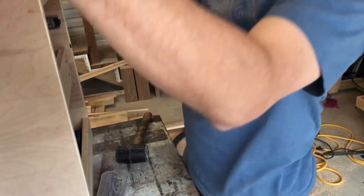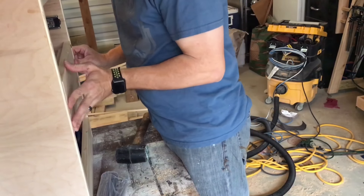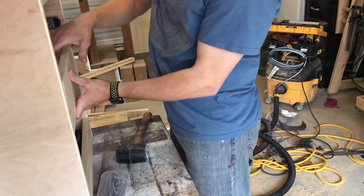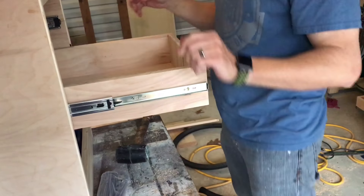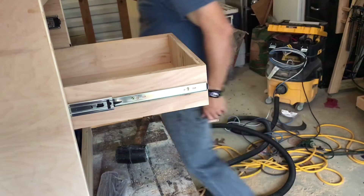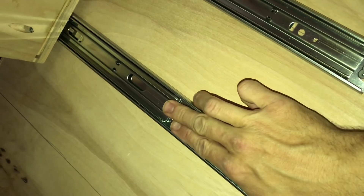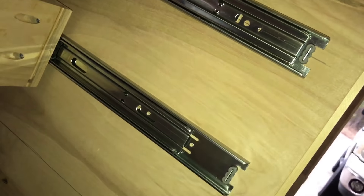Just actuate — is that a word? Then I'll take this and check it. This side's good. The right side I'm going to bring forward about a thirty-second of an inch — I don't have that tied down yet, but I've got those slotted holes that let me loosen the screws and push it forward just a little bit. That should make everything just right. Now that I've got everything like I want, I'll just push this forward and set the screw.